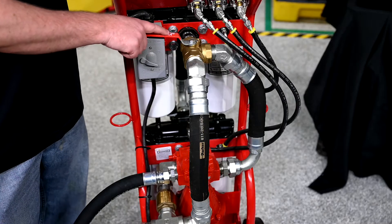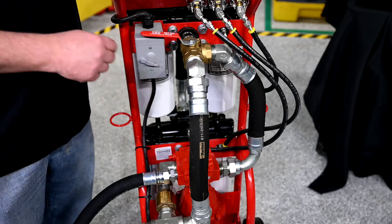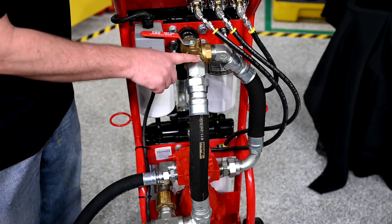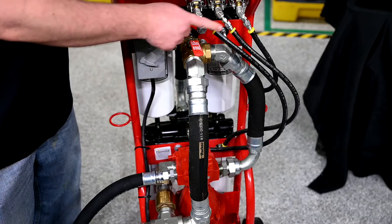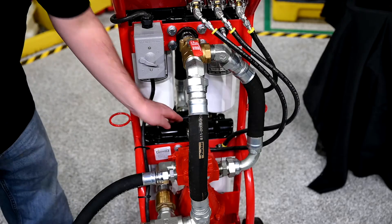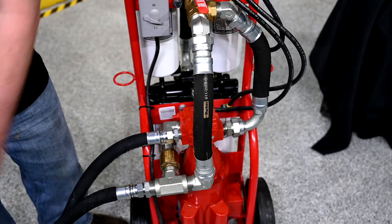The operational flow arrows on the handle will show you which direction your flow is going to go. Right now it's showing flow going up and out in bypass mode. If we change it the other way, the arrows show that the flow is going into the filters, down through the second set, out the back side, and out.